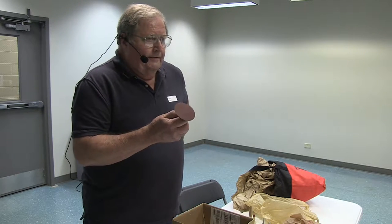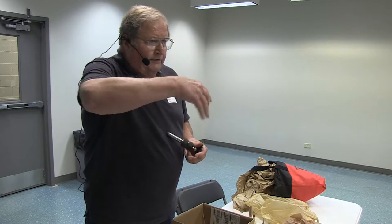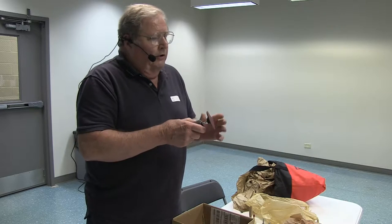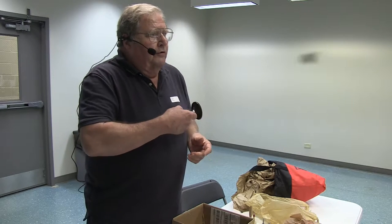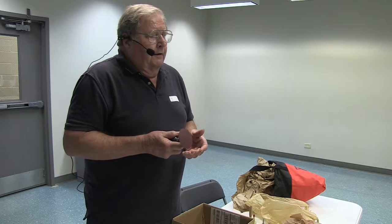I believe that this, with say 100 grit, will take most of your ripples or anything out, and it has a tendency of bridging over anything that's low. Everybody understand what I'm saying there? If you have a little step, you'll actually hit the high spot on the step. That fly didn't like to be there. But anyway, you can knock those surfaces out and get a good smooth surface. It's not going to be scratch-free by no means. Take a real good look at that surface right then and there. If there's anything in there that shouldn't be, continue with that heavy grit.